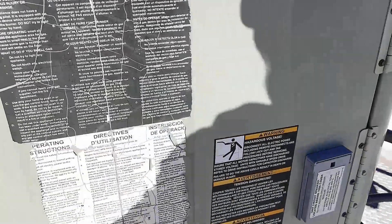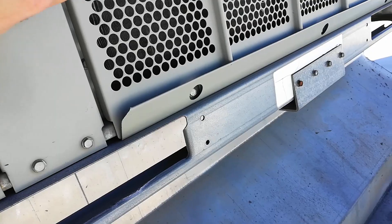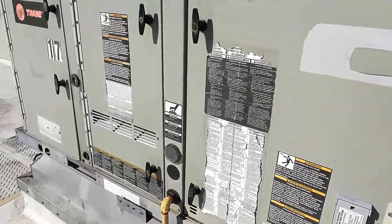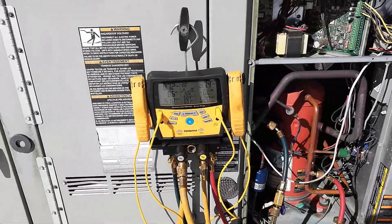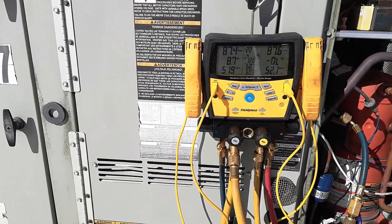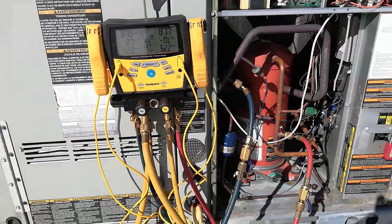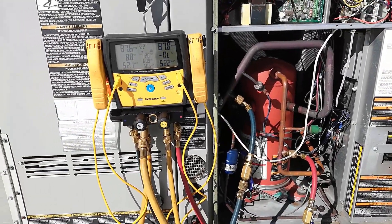Looking to see if I have any power on this unit. Looks like I have a convenience outlet, and it's green, so no need to bring up any extension boards. I got the recovery setup hooked up right now, but I'm first going to run it and replicate the symptoms I was getting last time — really high superheat, really high subcool, freezing of the TXV. I just want to make sure we've got the same thing going on today so I'm not replacing something that doesn't need replaced.